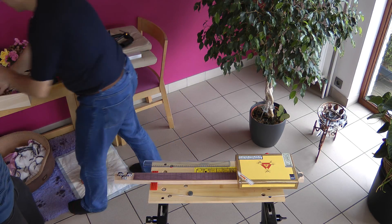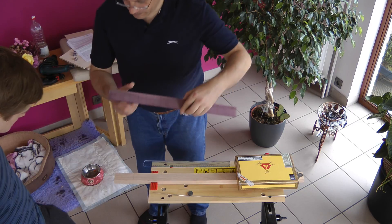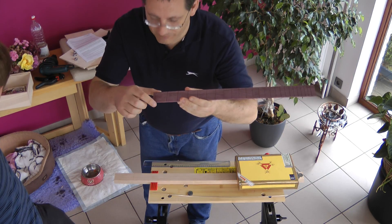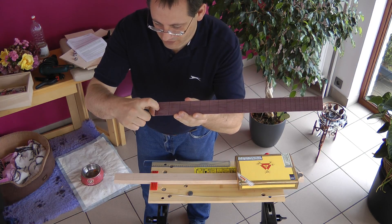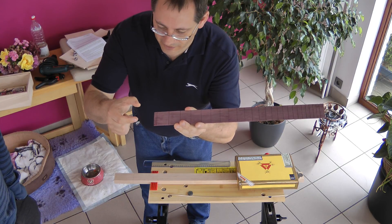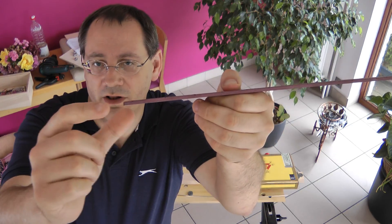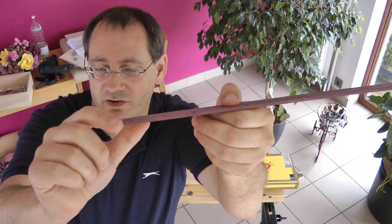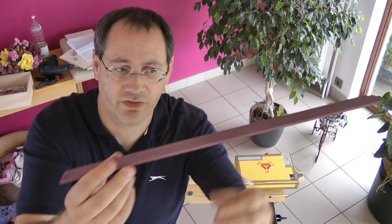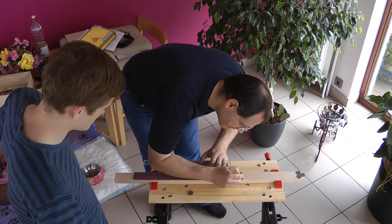For the purposes of gluing the fretboard to the neck, we can mark a line here. What we've decided to do about the nut — which is a bolt — is to cut a groove where the zero fret slot is and then bed the nut in there. The end of the fretboard we're going to cut down a bit so that it angles down into the neck rather than coming at a 90 degree angle. We'll angle that down, and it's best to do that before we glue.